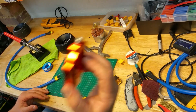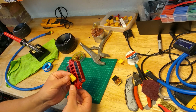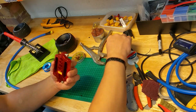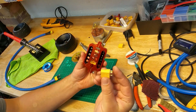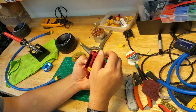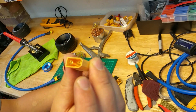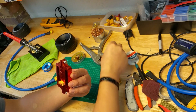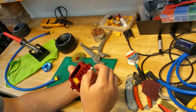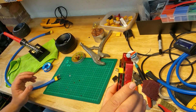So I've got this little tool here — full review on my channel. I'm inserting the connector I need to install into the relevant XT-90 slot. Done. This is just my recommendation: use the female side of the connector as well when you solder — put them together. The reason is you apply a lot of heat and sometimes the connector's internal contacts actually move and the distance between them changes, making it really hard to use the connector. Assembling it while soldering keeps everything in line, so after it cools off it'll be fine. That's a little gadget — very nice.